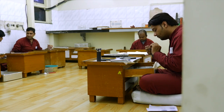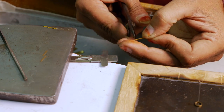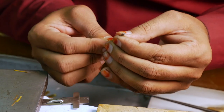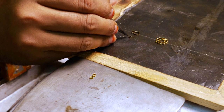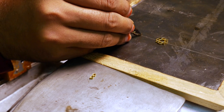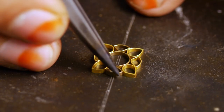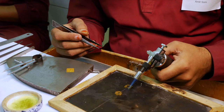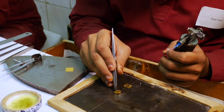In the goldsmith's workshop, the walls of the jewel's components are formed from strips of gold. They are laid out in position onto a waxed board. The components are then released and placed onto the gold sheet that will form their base.